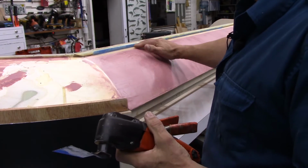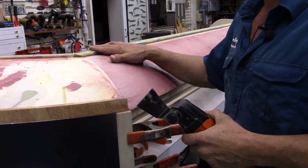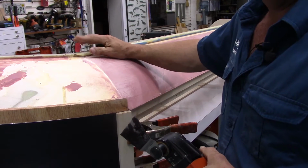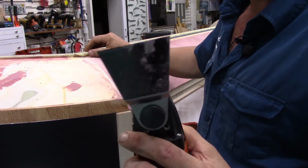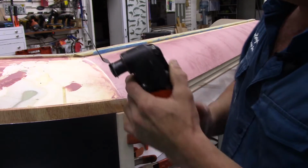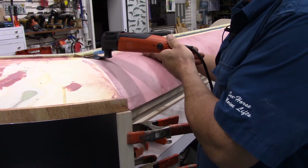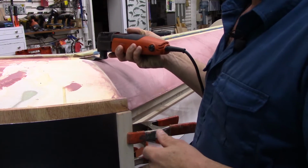Okay, so we have to cut this off all the way along, which is actually a good thing. It's going to shallow the console up from the visual on the bridge. So even taking that much off will help create a little bit more visual out to the boat. What I'm going to use is the Fein tool, the Fein saw, which has an offset blade in it. So it'll hold it flat here, and it will follow the contour up as I'm cutting it so it matches the console. Now this is going to be loud, so I'm going to put my earplugs in and crank some octane.